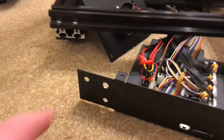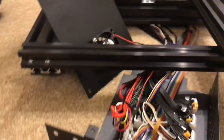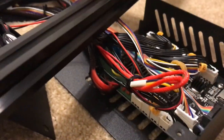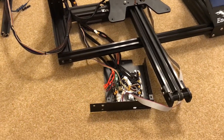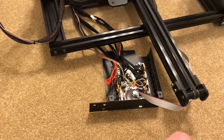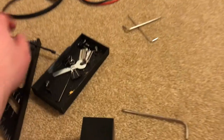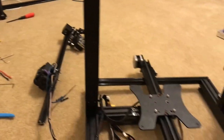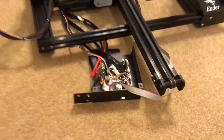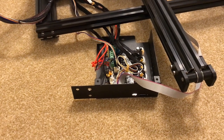The new hole has been drilled right here, so we should be able to mount the mainboard properly with both bolts. I'm also going to go ahead and crimp ferrules onto all of these power cables going into the screw terminals - there's no better time to do it. Amendment: I need to add the wire extensions first, and I noticed a lot of them actually do have ferrules on the ends already. That's a big thumbs up for Ender Extender for actually bothering to do that where Creality wouldn't. Whatever doesn't have ferrules after extending the wires, that's when I'll terminate them.